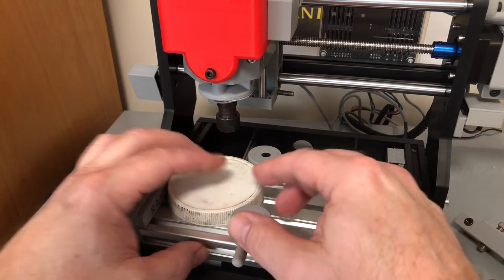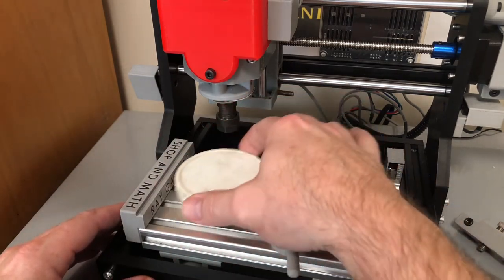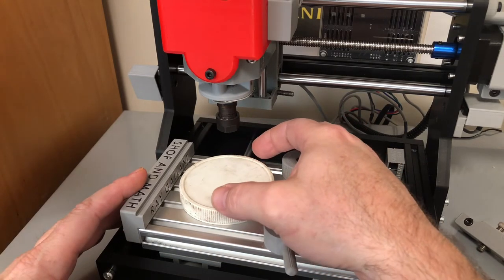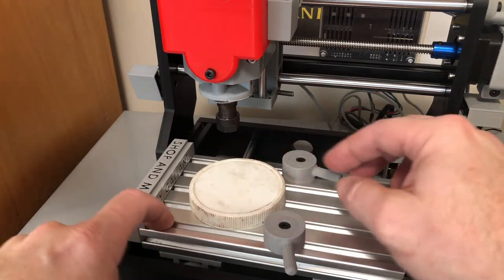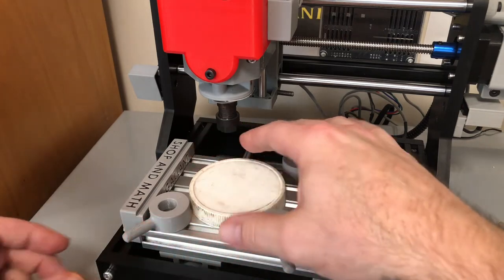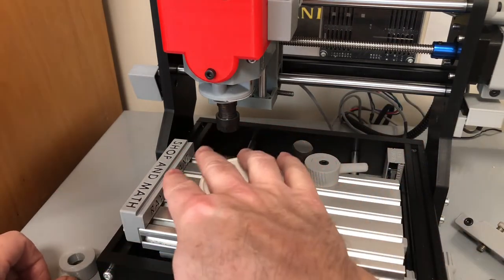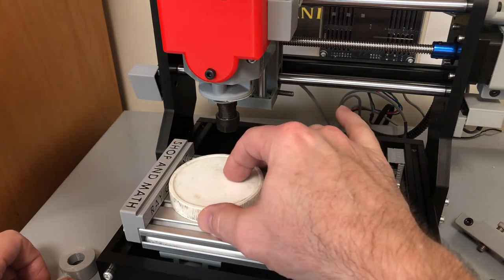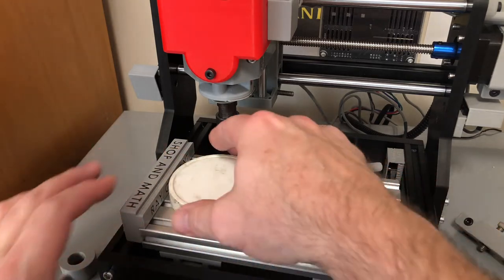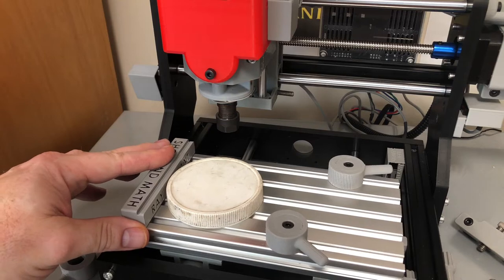Same with this guy here — I'm going to go this way to this way, and that'll be my tightening action. Now you might ask: what if I wanted a repeatable setup? Well, this is not a repeatable setup as shown. But if I wanted one, I could put two cams here that are permanently tightened, one here and one here, and that'll automatically push up against the piece. Or I could machine a V into one of these and the piece will sit in the V. Right now it's a non-repeatable setup, but I could also put stops up against it.